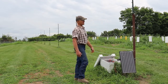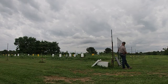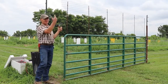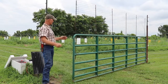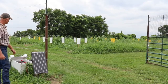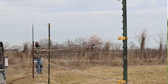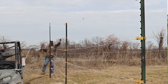At gates, we took a normal farm gate and used rebar and some plastic netting — this is actually a deer fence of a different style we have elsewhere on the farm. This is not electric, but it just allows us in and out of the area we're trying to protect. It's a continuous loop, so when we first start the poly wire we go all the way around the entire perimeter and then continue that line so it's one continuous run.